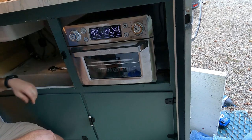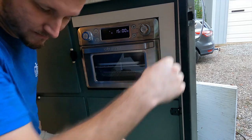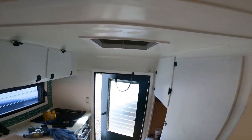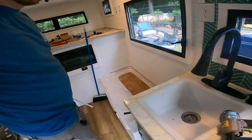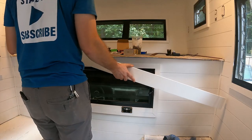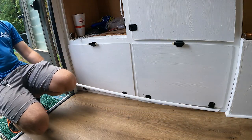We're ready to cook something — we'll make a nice face plate cover for the toaster oven too. We got a good bit done yesterday but realized it didn't get recorded, so I'll just show you what we've got. We started out in the corners with this flexible PVC quarter round, running it up along the corner and across the top all the way around the inside of the camper. We've got PVC flats going across the top to cover up the screw holes from where we mounted the ceiling. And one of the biggest things — we have the floor done! This is an LVP flooring, and the only thing left is to put the quarter round along the edge. We'll finish that quarter round trim out, get the board cut for the bed placement, get the bed in, the cushions in, and the table in.